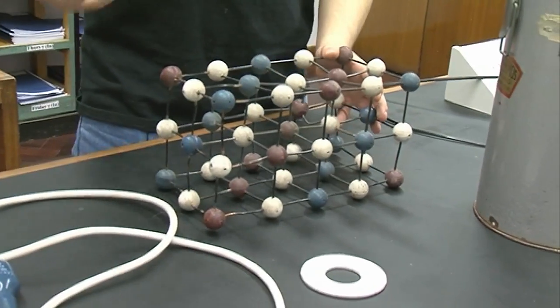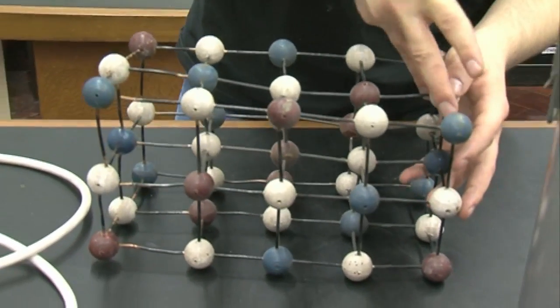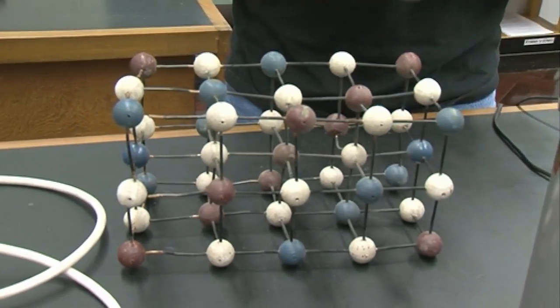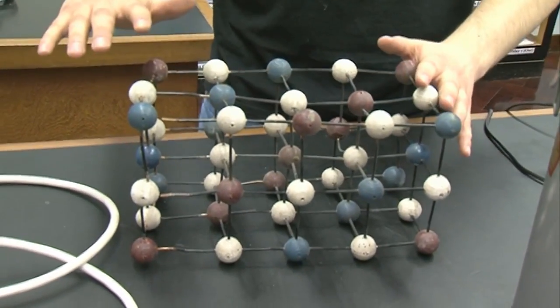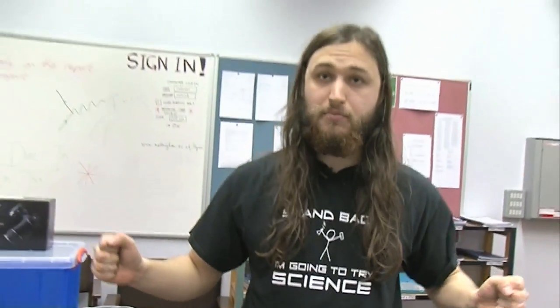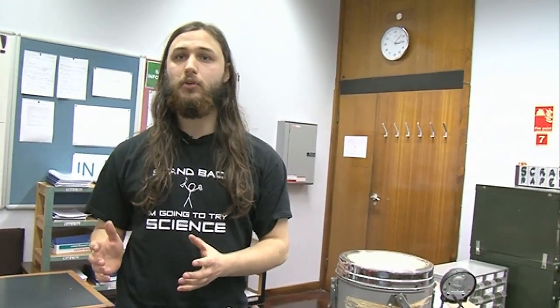So the current that we're trying to put through it is made of lots of electrons. And electrons can move through the lattice if it's nice and periodic. Because of quantum mechanics, they're waves. They like to move through things which are nicely arranged. But if you've got the atoms vibrating and moving towards each other, it's suddenly not periodic anymore. The electron comes across the sound wave, the atoms vibrating, and they'll knock it off.